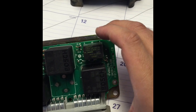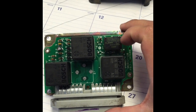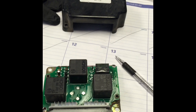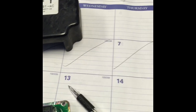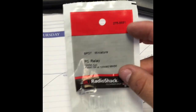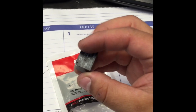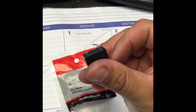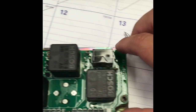Now this relay here — you're not gonna find it at the parts department or at the dealer. They'll want to sell you the whole box, which is roughly over $300. But from Radio Shack, part number 275-0031, is technically the same relay.